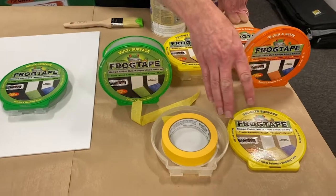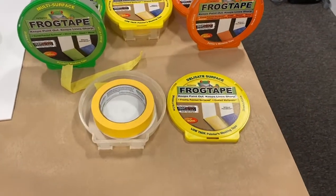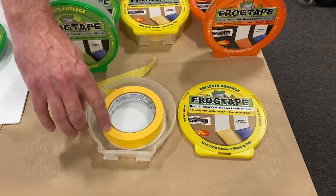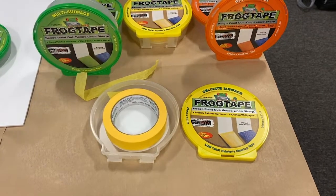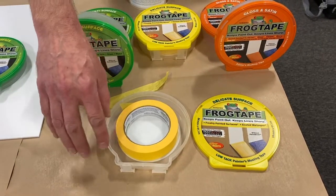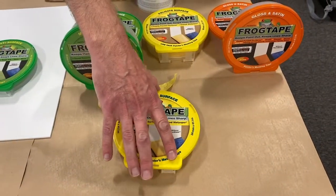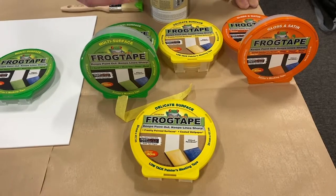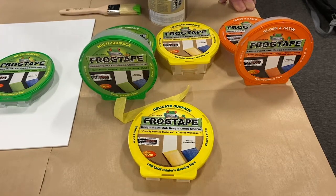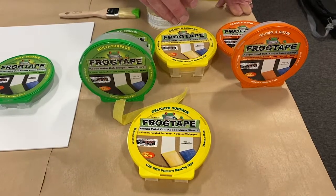The reason why Frog Tape is supplied in a box is that the box is there to protect the edge of the tape. What you're using masking tape for is to get a straight line — the edge gives you that straight line, but it's also the easiest part to damage. So if you damage the edge in any way, it's no longer a straight line. By replacing it back in its box as you're using it and when you finish, you'll use an entire roll of tape. Think of how many times you've thrown another brand of tape in your toolbox, it's got nicked on the edge, and you've never used all of it.